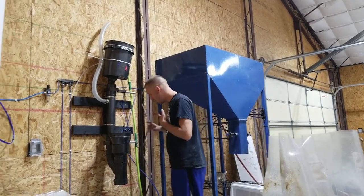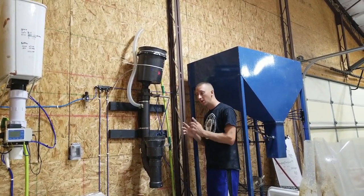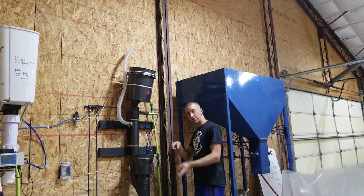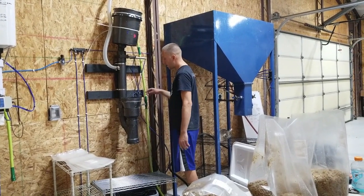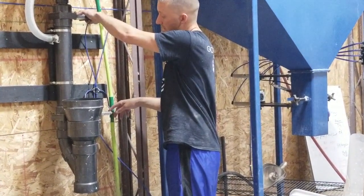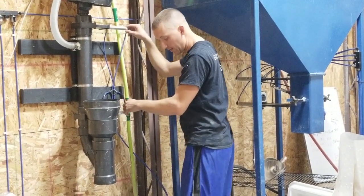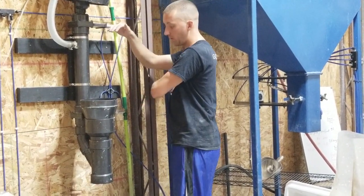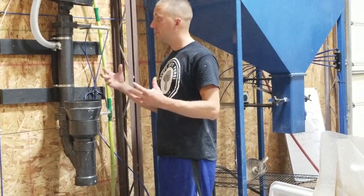Really quick with the airlines — this is a five-way valve pedal. One pedal basically switches the air pressure between your A and your B port. There's your in and there's your A and your B. So you're going to have the A and B port coming up here, with constant pressure on the backside. They're going to cross with a T, and then when you apply the pedal, it'll put pressure back here, which will shut this valve and open this one. That's pretty much how it operates — that's how my dry bagger operates, and it's effective.